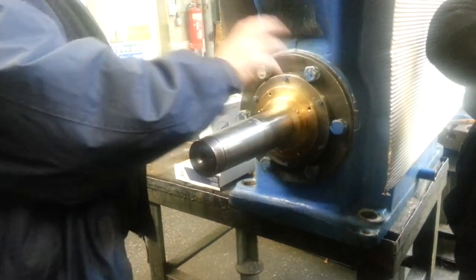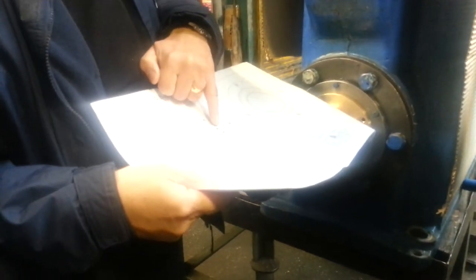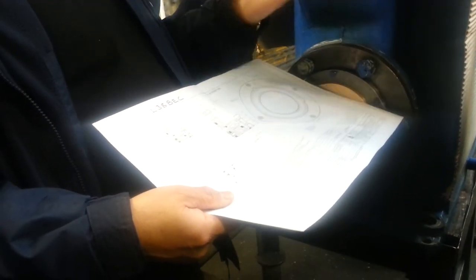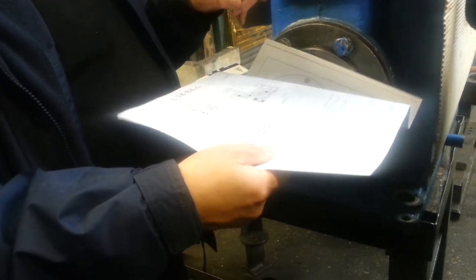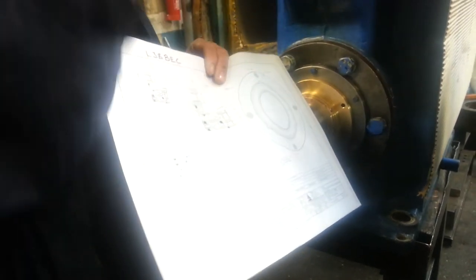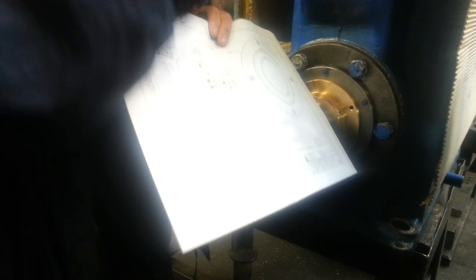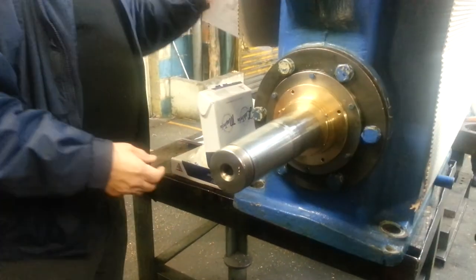I use the pins — they set the working length of the faces within the seal. So what we have here is a rotary face and a stationary face, and these springs actually push them together and generate the closing forces, because you've got no pressure in here whatsoever — you've got nothing to assist the seal to actually keep the faces together, so the springs do that. What we want to make sure is that they're in the correct position, because if there were no springs there'd be no way of ensuring that the faces are always touching. They don't actually touch because what we have is a fluid film between them. So the springs ensure that gap is there all the time — if that gap gets too big, there's no seal, and if they get too close together you'll burn the seal out very quickly. So once that's locked up, you remove them and that's ready.